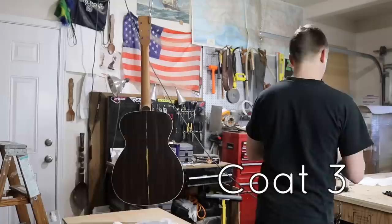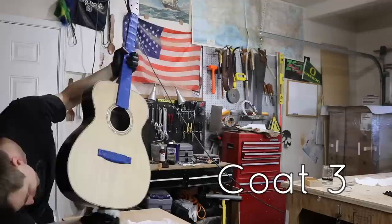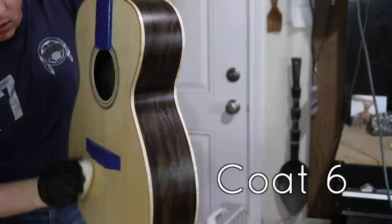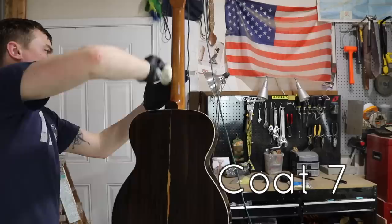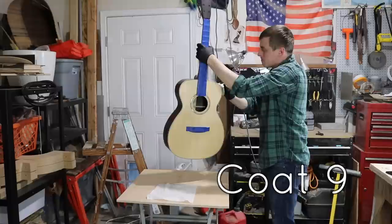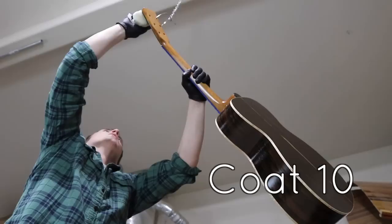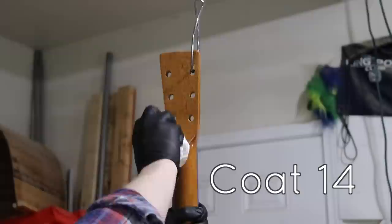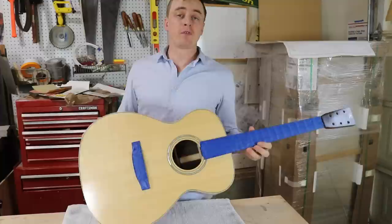Here's the full third coat in fast motion so you can see it start to finish. You have to make a new mouse for every single coat — be careful when you dispose of them because they are spontaneously combustible. The main thing you want to be thinking about is keeping the coats thin. It's better to go too thin than too thick. Especially when you're doing this 15 times, all it takes is one drip to make an imperfection. Nobody is really going to notice a drip except the builder, but we spent a lot of time building this guitar, so it's worth it to take your time and do this as well as you possibly can.